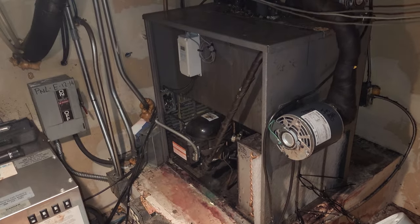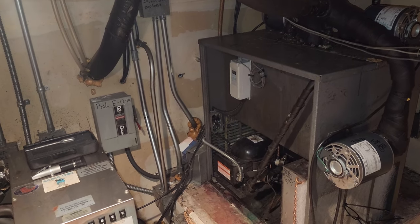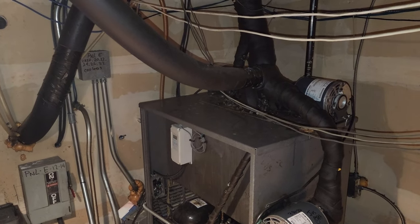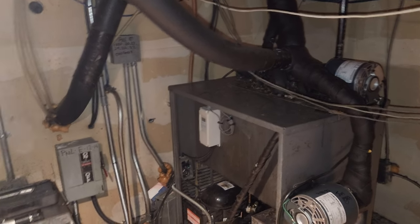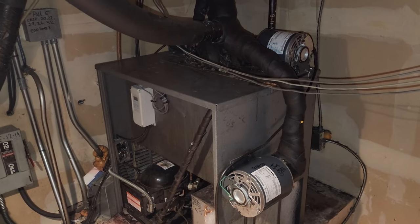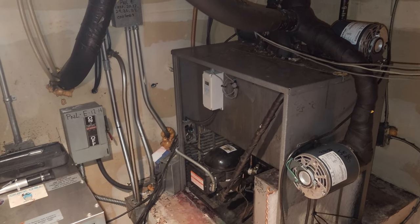In this situation, they're going to have to call the beverage company. I don't think there's anything wrong with the refrigeration system — it did say 30 degrees when I got here. The last thing I'll do is turn it off at the disconnect switch, plug the pumps back in, and we'll let the pumps recirculate the glycol. I'll tell them to call the beverage company right now so that when the beverage company gets here, all they've got to do is flip the disconnect switch on and refrigeration will start again. I'm just going to check the accuracy of the thermostat to the actual glycol temperature with another thermometer to make sure that's good.